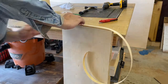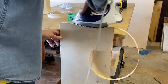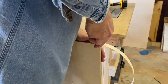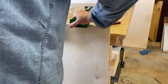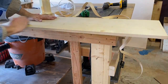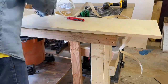Next I was going to edge band the shelves. I cut them out of three-quarter-inch birch plywood and just used an old iron since my wife upgraded — works great. You just iron those on and trim them to fit. Make sure all the glue is securing everything nicely, then just trim it with a nice little edge trimmer. Then I just take a little 220 on a block and sand everything down nice and smooth.